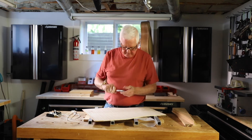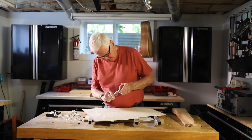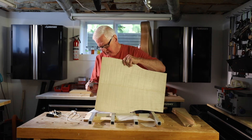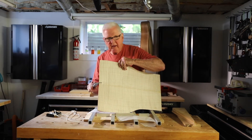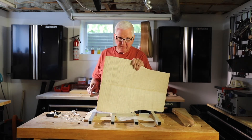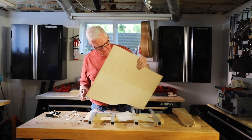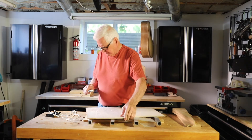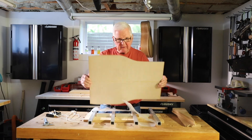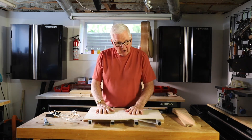This indispensable tool is back at it again today, and what we're looking at here is an overall thickness. I just want to make sure I know what I'm dealing with. We're at 2.2mm — this is going down to 0.95mm. The reason I want to know this is because the shell depth is about 0.50mm, so I don't want to take too much off of this.